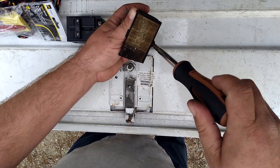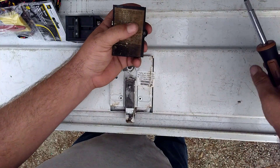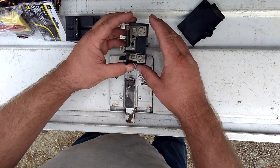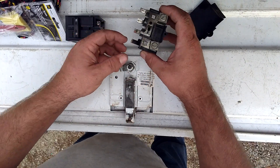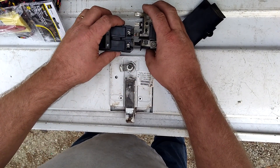It's a really common problem with these things — electrical failures. You can rewire them, but sometimes they get to a point where you just feel safer replacing it. This point distributes to, let's say, one and three. This point goes underneath and distributes to two and four. You can see how black this one is; it was heating up quite a bit on this bottom breaker.